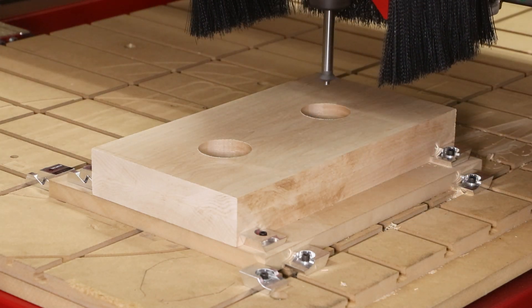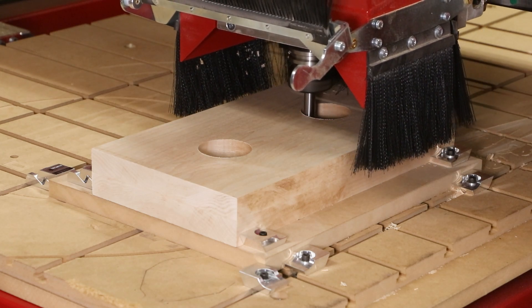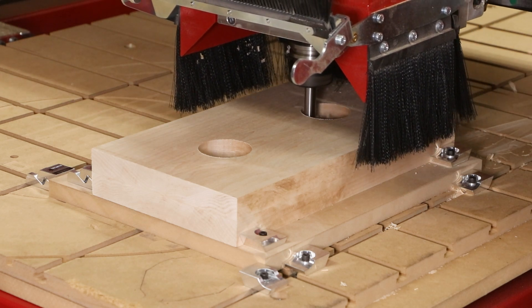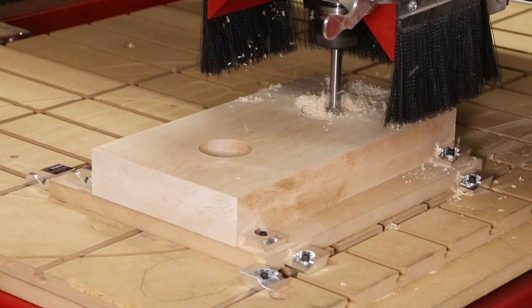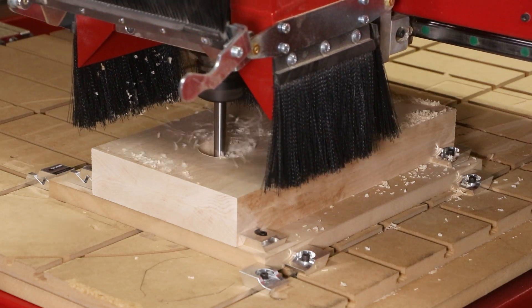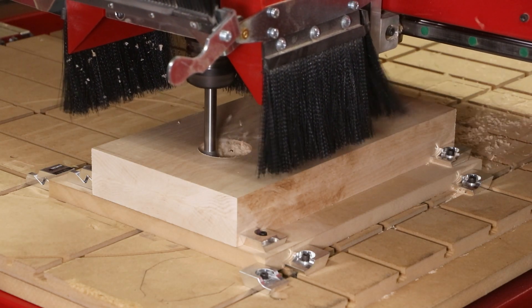Now the side V cutter can get to work by starting from the bottom and spiraling upward. This is giving us a quarter-inch pitch, which is four threads per inch with a right directional thread. This will match the thread pattern that was produced on the threaded shaft. We also added about 25 thousandths of tolerance to make sure the threads don't bind as the wood changes between seasons.